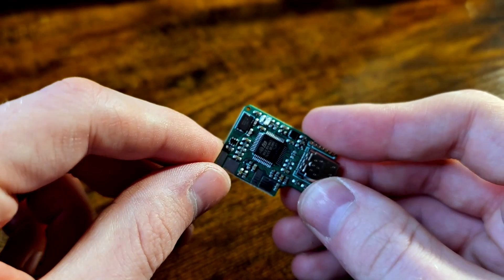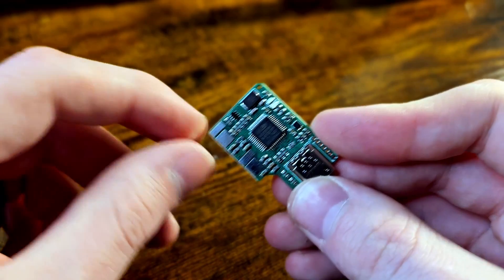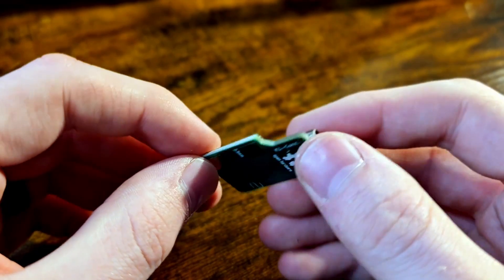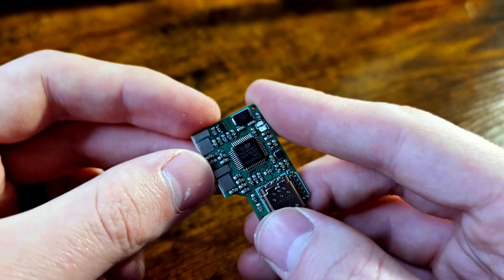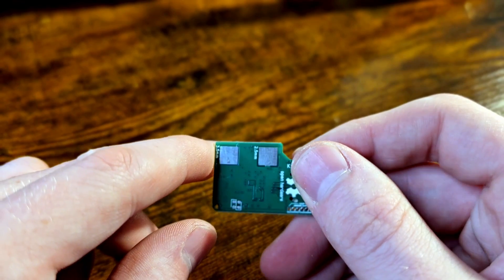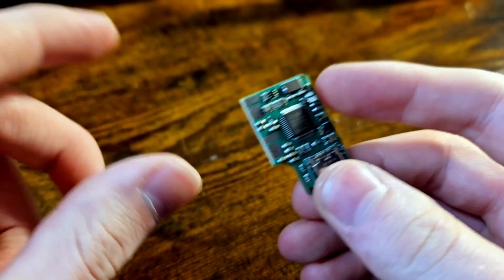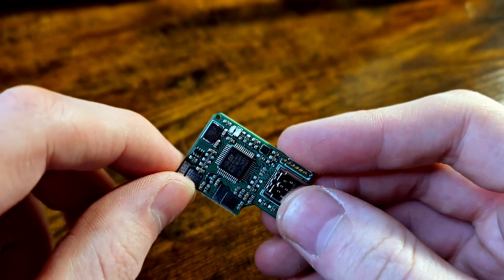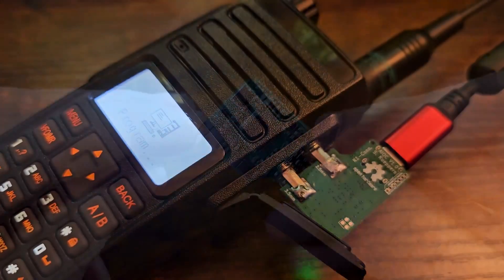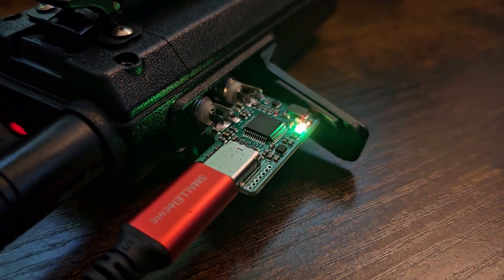This great functionality was largely limited to handheld radios for a number of factors. Firstly, the pads are designed for that connector, and adding other connectors by cable is a bit difficult. The pads are not clearly labeled, and a lot of functionality is shared on them. Additionally, the serial interface runs at 5 volts from the computer, but most radios are designed for 3.3 volts, and this high voltage input can actually cause damage over time.